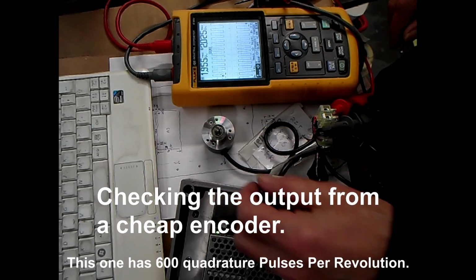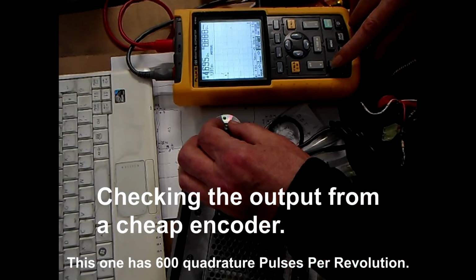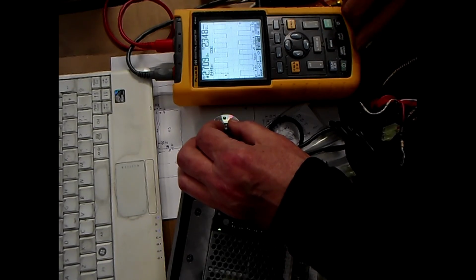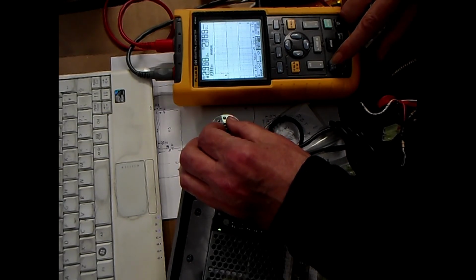The G-code is produced from CAD. When run, the spindle is turned on, the L-box powers up, a few lines of instructions, then an instruction to turn off the spindle. The L-box is running, but for how long? The spindle didn't have power for long enough for the motor to turn. You couldn't hear it turning or moving.